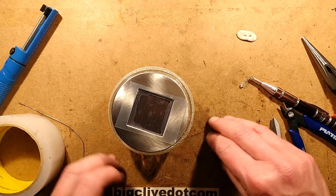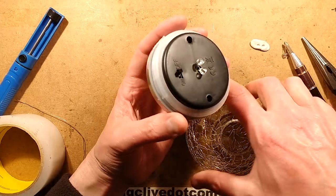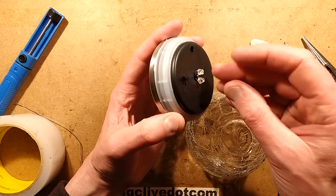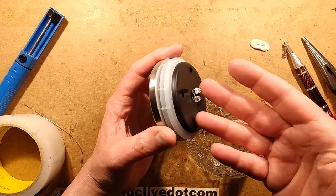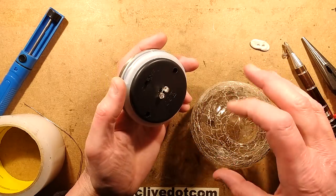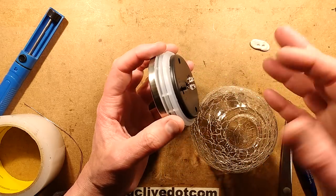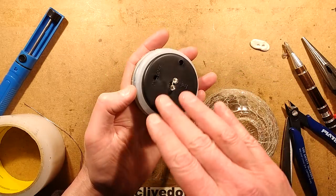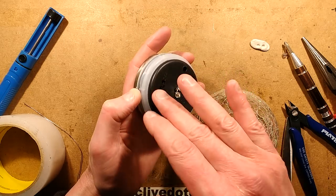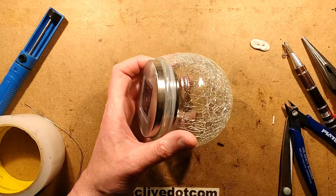The light's going on again. It's actually a letter from someone so I don't want to give their details away. So that's a very easy modification to do: take out the single LED, put two in series of two different colours. It could be red and blue, or warm white and cold white, or even two of the same colour — it creates more of a visual effect through this crackled glass. The blue and green is really attractive — they complement each other well. And because I've soldered across the switch, it's not going to have that corrosion issue. That's a good result.